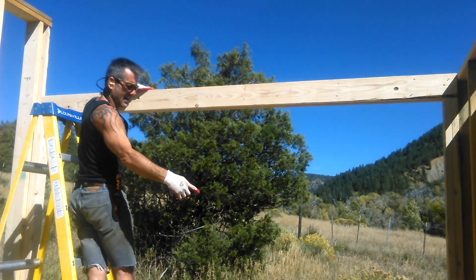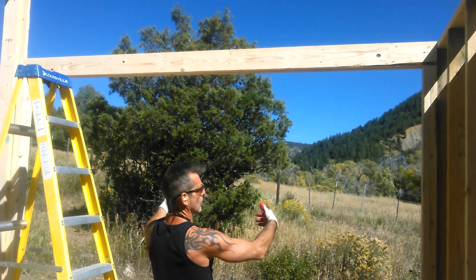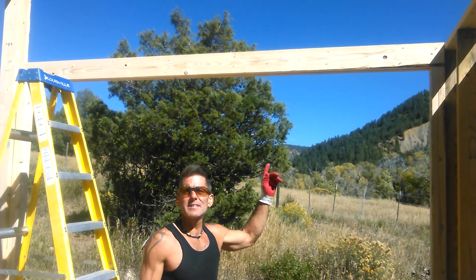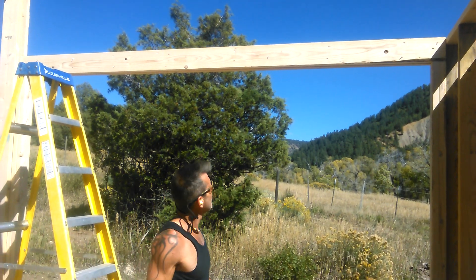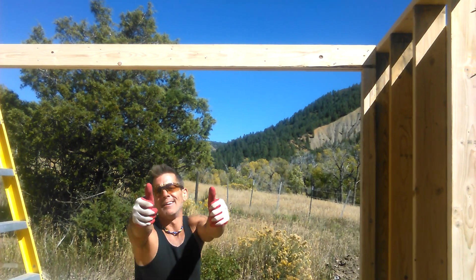And there it's in. Now the whole front of the barn can be open and I can build a door. The reason I used 2x6 up there instead of 2x10 is because this is going to be a facade wall and it's not going to hold the roof weight, so I save money by doing that. I hope that helped you save some money building your own beam. Thanks for watching.